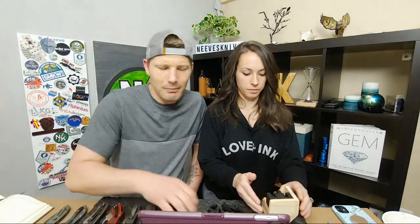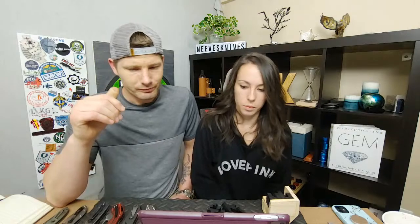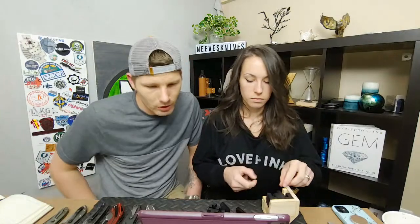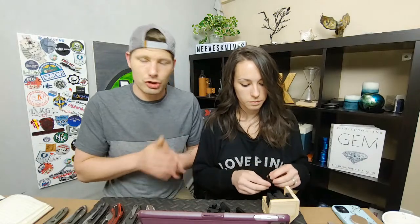The hardest one I've ever sharpened — I don't consider them hard, maybe it's just time. The longest was that one S35VN. For a good heat treat, probably 20CV or S110V or S90V. The thing is, with a good heat treat they sharpen easily on diamonds and strop really well. It's when the heat treat is fumbled that it seems harder — when it's too soft, that's when it's difficult.